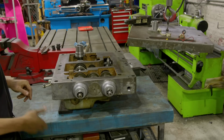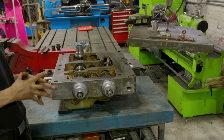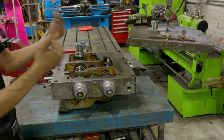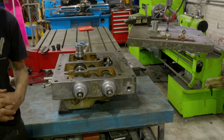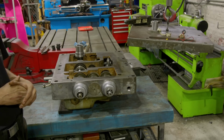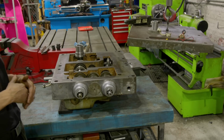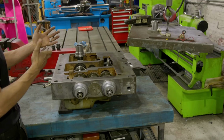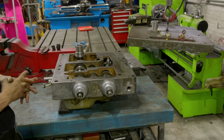So that told me that as soon as we filled this gearbox full of oil, it was going to leak down at the bottom, and I just didn't want that. So I took the time to back up and redo that one and a couple of the other ones just to make sure we're not losing any fluid. Each gearbox is designed a little bit differently. This gearbox has a lot of holes and protrusions, and they use seals. Seals are a really good method, but if the journal is smoked, then it's just going to leak like crazy. So I wanted to make sure that was dialed in.